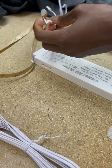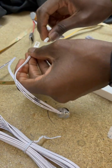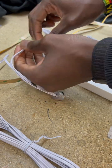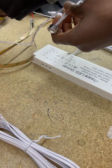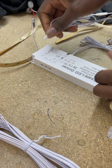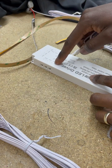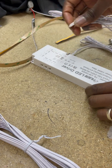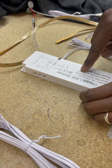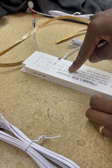To connect this into this, connect the other end into any of the outputs. So imagine you have one, two, three, four, five, six, seven, eight, nine, ten single lengths. Of course it depends on the size of the LED driver — the 100W has 10 outputs, and the 30W and 60W have fewer outputs.